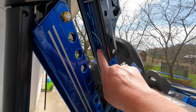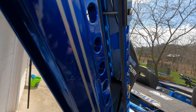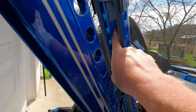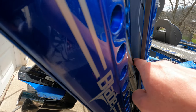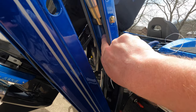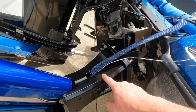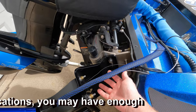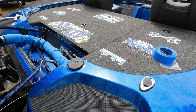Quick look at the wiring: when you put the bottom bolt in, make sure your wires are up over that bolt. I did put some tape back there to secure the wiring. The wires run down over the knuckle, up over the top of the piston, and they pop out at the bottom. Then you bring them down following the hydraulic hoses through the channel, and they pop up here. My only complaint is that they don't give you quite enough wire, but that's a minor issue — I have plenty of 18-gauge wiring and butt connectors to extend them.